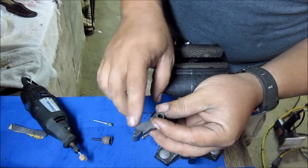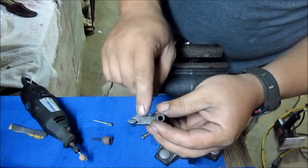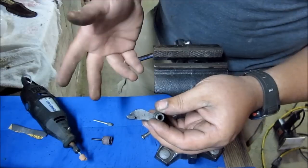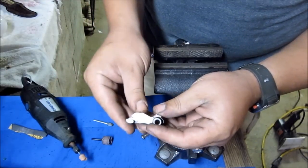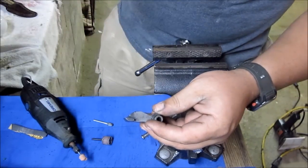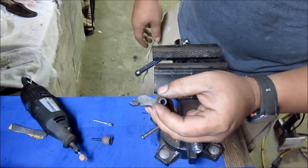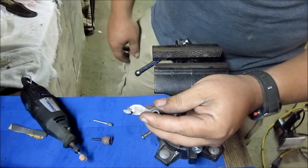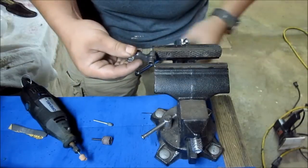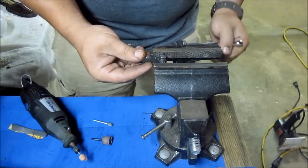Don't worry about taking too much off — you can kind of see how much you need to take off. Go ahead and look at it, dry fire it a couple of times in your weapon and find out where it's making contact with the firing pin. Don't take off a lot in that area, but don't worry about taking off too much because this is a big fat hammer and they're made to make contact with the firing pin. Basically what you want to do is just change that angle, and you'll take off enough to where you won't have hammer snag and it'll still make contact.